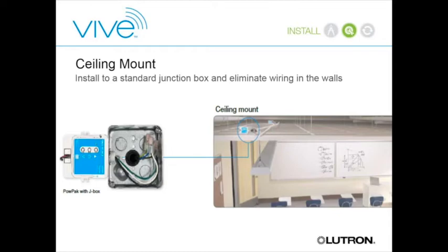The reason we made ceiling controllers is for retrofits—it's not likely you have zero-to-ten-volt wiring already installed. If you put the zero-to-ten-volt controller on the wall, you'd have to fish new wire down the wall, which doesn't make sense. Instead, we put the controller up on the ceiling and pair it wirelessly with a wall control, making installation much easier for the contractor.